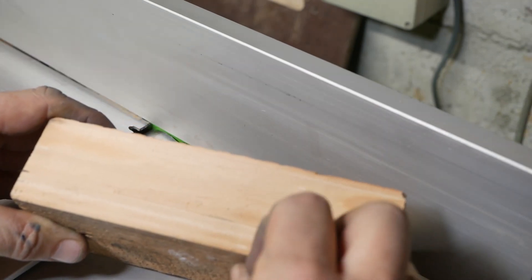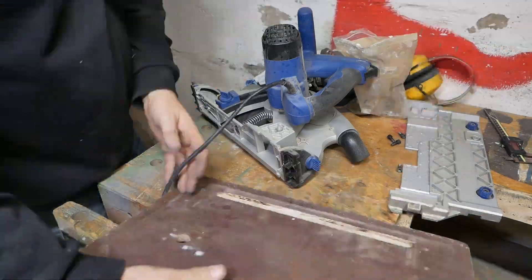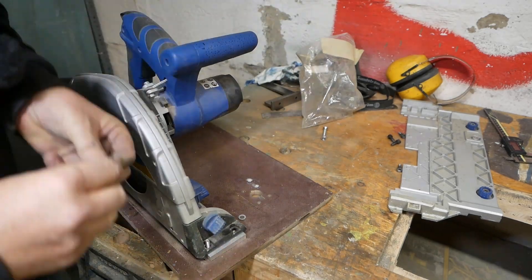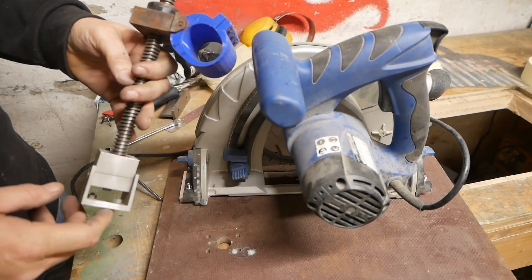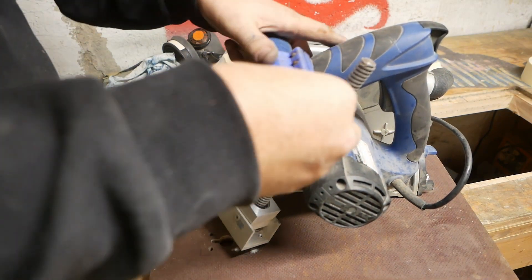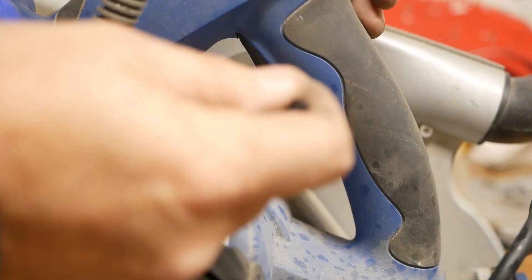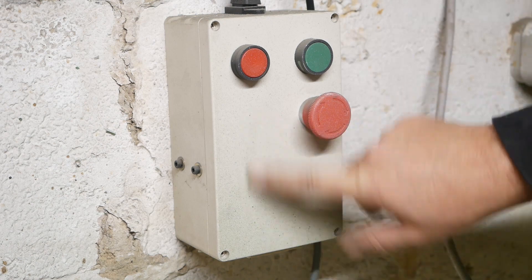Well, it's still not perfect but it's better. The table saw is just this saw hiding upside down. To be able to adjust the height of the blade from above, I made this Rube Goldberg machine. I 3D scanned the saw with a camera — that's why the little dots are on it — and then made a matching sleeve to go over it. It's 3D printed. This is the old lead screw from my lathe actually. This bolts on from above and the trigger gets tie-wrapped on. For added safety I put this box on the wall — it's got a safety relay in it so I can e-stop it.